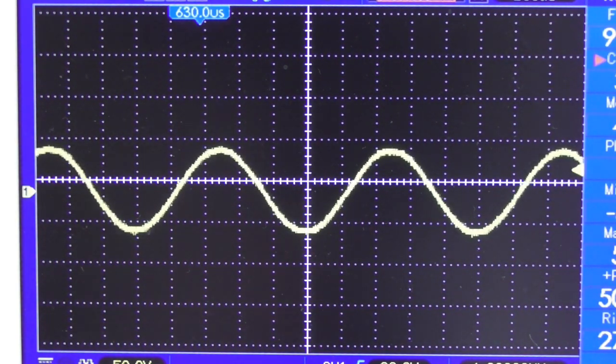But the problem is the amplifier, which you've probably seen me building and testing, is so good, using this preamplifier will mess it up, because it has roll off on the HF, and to me it's completely non-hi-fi. If you have something that isn't very important, this preamplifier will be fine. Its gain is adequate, and you can increase the gain by changing a couple of resistors, but you'll still have that failing HF response. Well, it's 2 days later now, and never one to be giving up too readily.